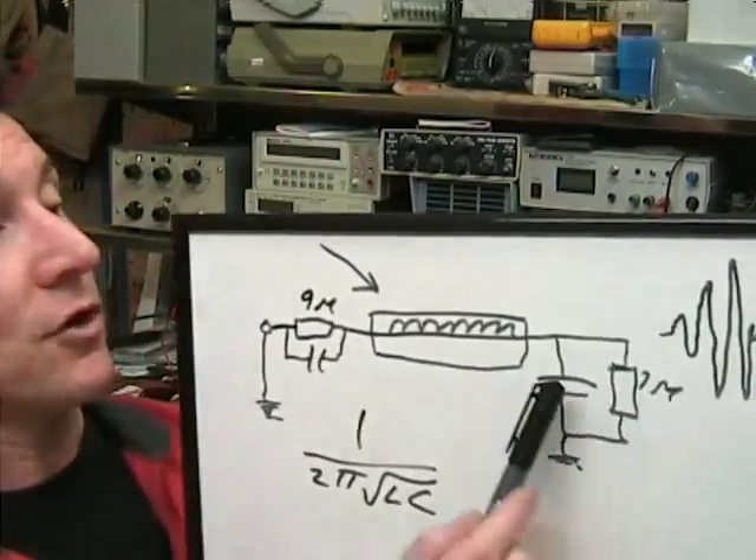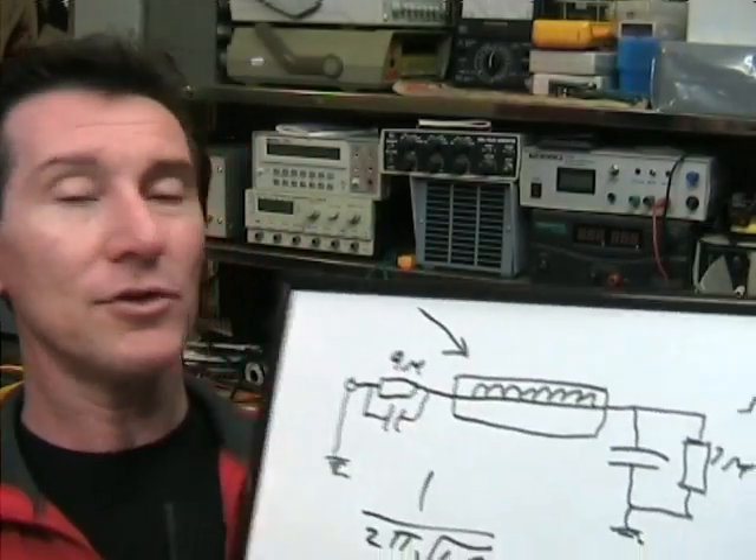There are quite a few complex factors involved, but if you do some basic back-of-the-envelope calculations, it turns out that based on the inductance of a typical coax cable and the input capacitance of a scope, it's pretty much always going to resonate at around 100 to 120 megahertz. And you can do this on practically any scope and any probe and get a very similar result. You can also get this phenomenon with a times-one probe as well, and also just a regular coax cable if you're lucky. It really doesn't discriminate too much.